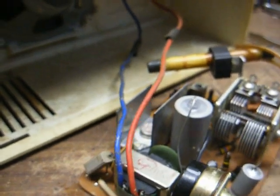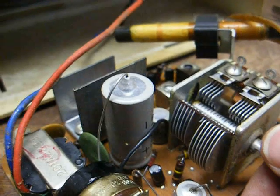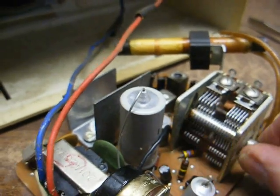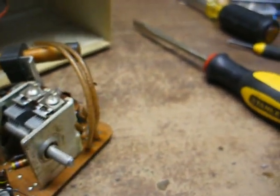There's 10-10, but it's very weak and distorted. So this thing still needs some more assistance. Several of these GEs, I've seen resistors — especially in the front end — go out of tolerance and either cause the mixer stage not to work at all or work very poorly. So I'm going to check that first.